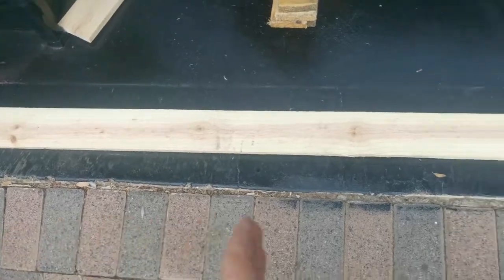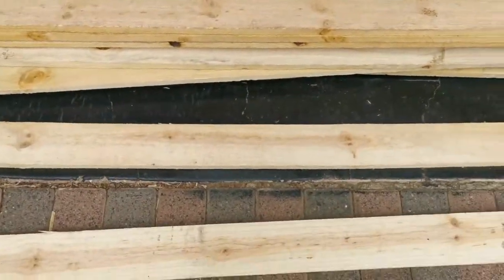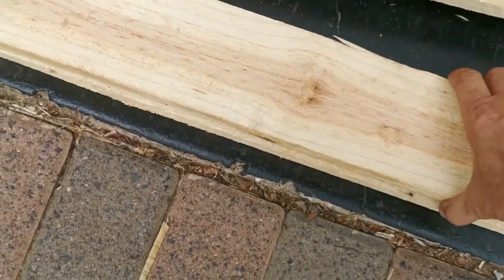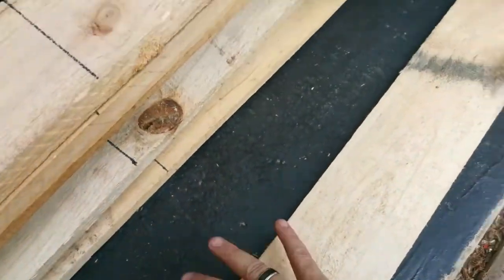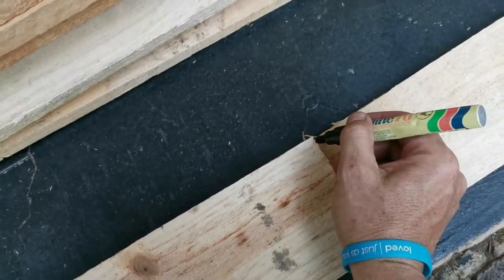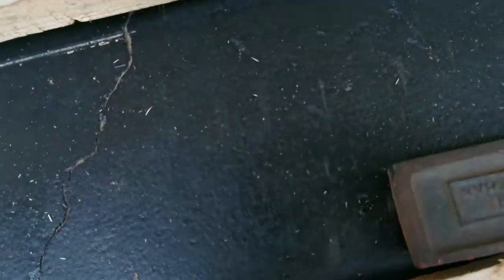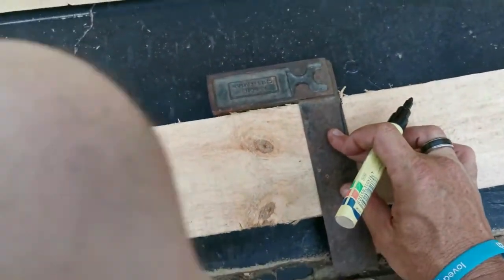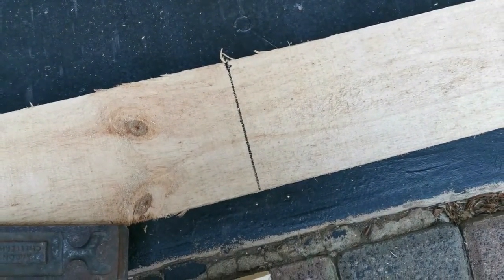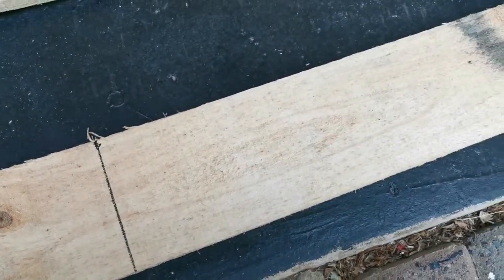I'm going to take the remainder eight that I need from that pile and cut them all exactly the same length. What I'm doing now is taking the planks needed for one palisade, using the one I've already cut and measuring where to cut the rest so that all of the planks are exactly the same length. Then I take a square, mark it like so, and cut all of them in the same place.